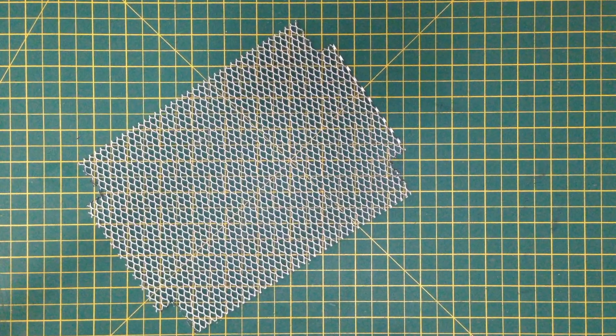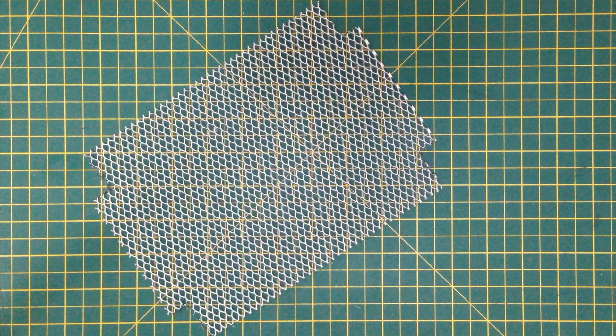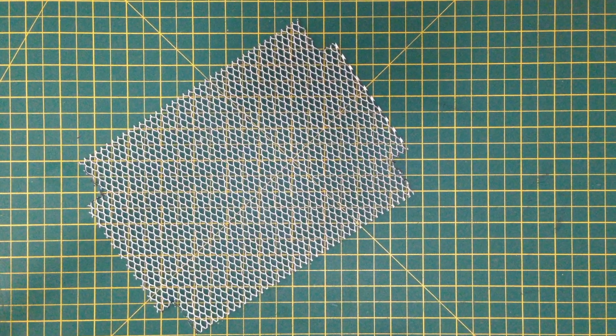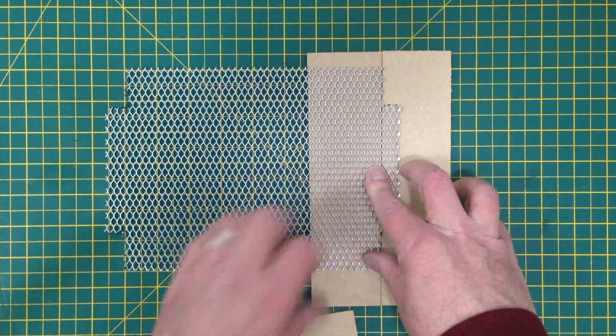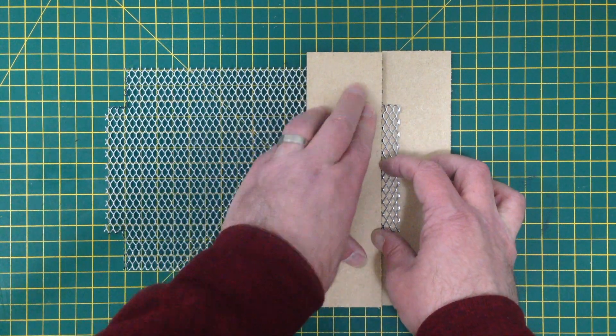At this point you could just make a basket and hang that into the frame by folding these tabs into an S shape. You just have to be really accurate with those folds and make sure that the bottom of the basket sits level with the frame. I chose to fold up just the shorter sides, and since I don't have a metal brake, I improvised with these three pieces of MDF that I pre-cut to use with the laser anyway.